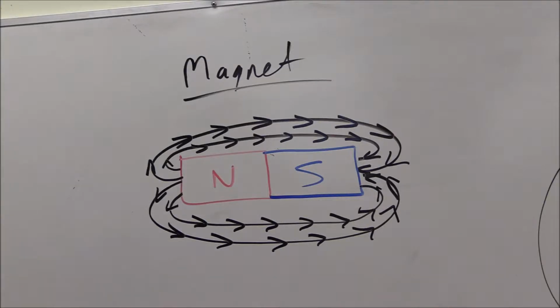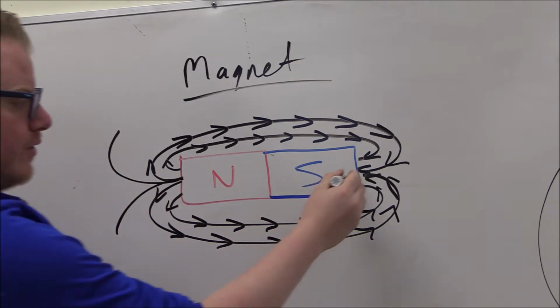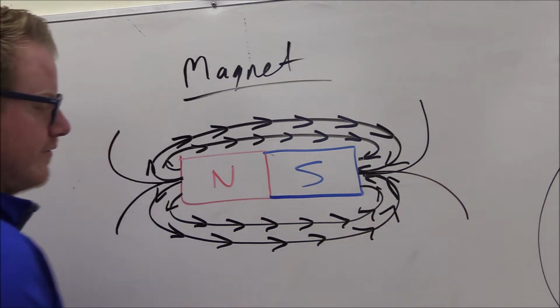One thing to remember is that magnetic field lines point away from the north towards the south. They're a dipole. That means you need both ends of the magnet for this to work. What you'll see is them forming closed loops. Even if they show them coming off and they don't show where they go to, those have to form closed loops because you have both attraction and repulsion.